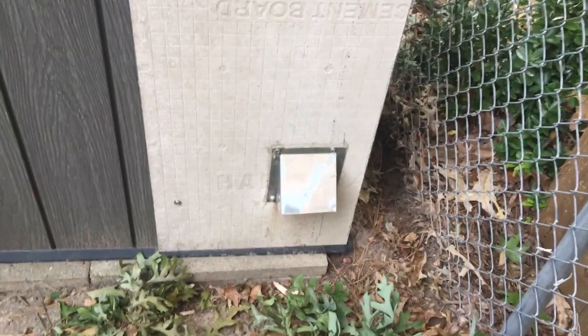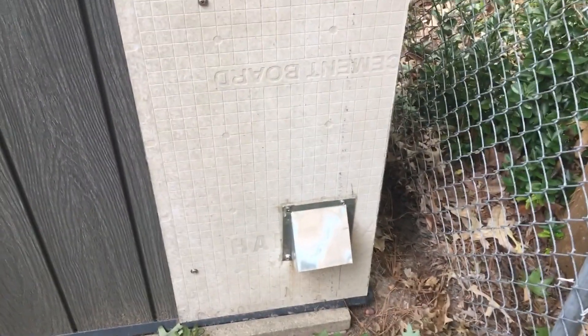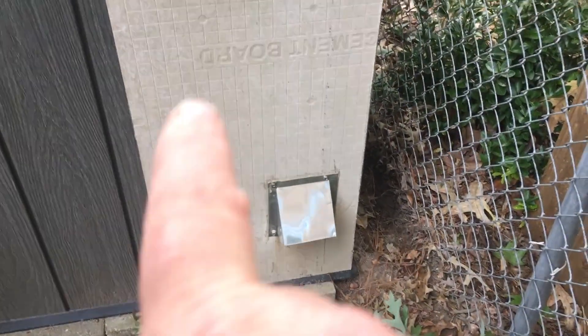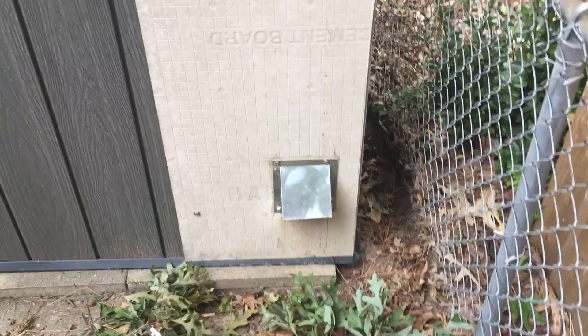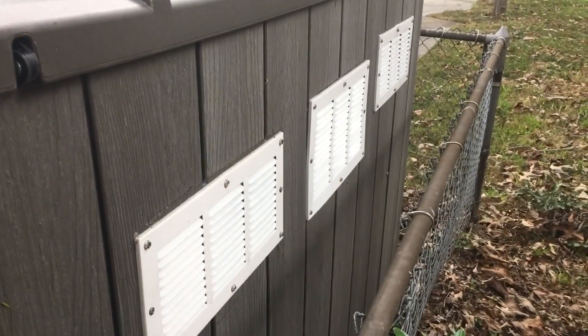Here I have a piece of hardy board and a dryer vent with a flapper for the exhaust. This hardy board is sandwiched with another piece on the inside, and I cut a pretty good-sized hole on the end of the box so I wouldn't have any problem with heat transfer into that plastic. In that void between the pieces of hardy board I put insulation. On the backside I have some more return vents from Home Depot.